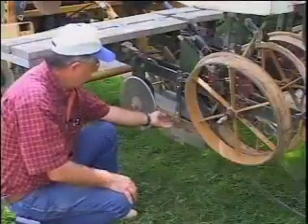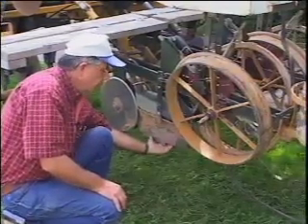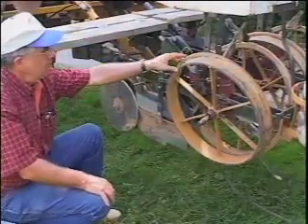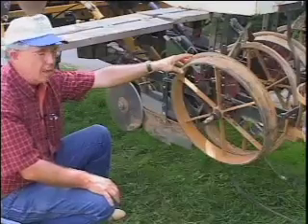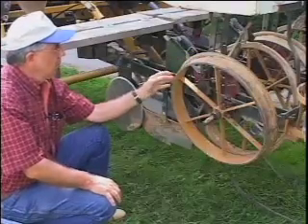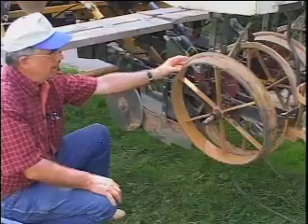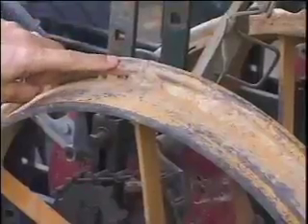This is the shoe, and inside the shoe we have a little ring that holds the drip tube as it comes through. These are the press wheels. This is not the press wheel that came with the planter — normal press wheels have the pressure on the outside. We had to reverse that, so we made a very heavy-duty press wheel with inside metal pressure. That way, when the soil is loosened and opens, you press it back with this press wheel.